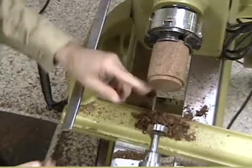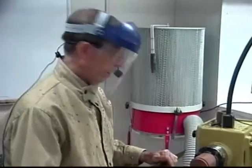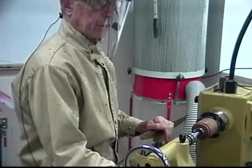This end is the middle top of the bottom part. That one they say 1/4 inch, and that's where your tenon will be from that plastic insert. And if you use the screws, go a tad over 1/4 inch, then it won't drag on there. And the depth doesn't make any difference because that's part of your pepper grinder part. It's just the clearance for the tenon, so go a little over.